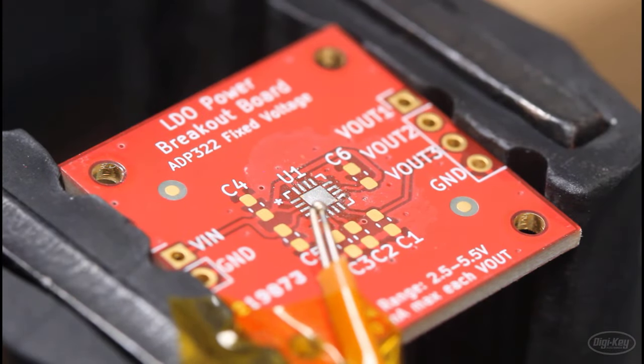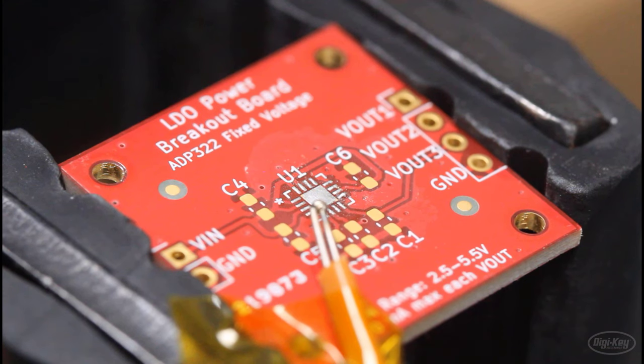The best I'm going to be able to do is tape the thermocouple down in the near vicinity of the part. This will at least give me a decent reading of the ambient temperature around the part during the soak phase, but I will probably have to do the reflow portion and part placement by eye and guess on the temperature. That's going to be a little tricky, but we're making prototypes here, not trying to do something exact.